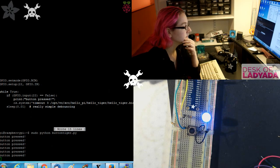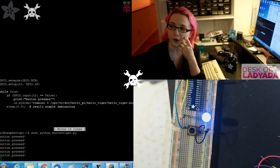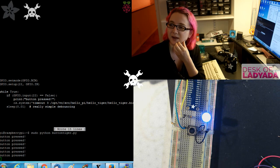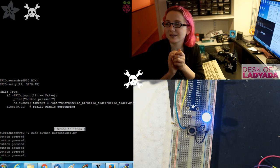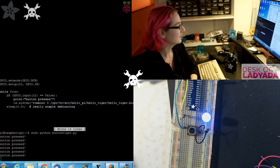Apparently, a reminder, there is a real-time operating system that can be added to the Linux kernel. I guess that's a response to the other question that someone's helping out with. Yes, just Raspbian isn't, and that's probably what you're using. I mean, you can write code for the chip itself if you really want super high speed. For a lot of things, unless you're doing absolute motor control by ticking each coil, a gigahertz is fast. You can do things pretty much whenever you want. It's almost instantaneous.